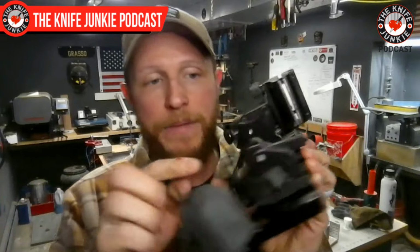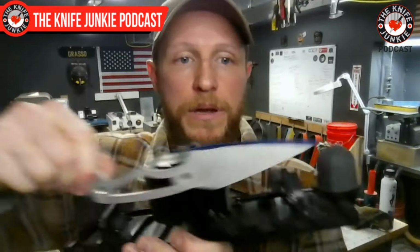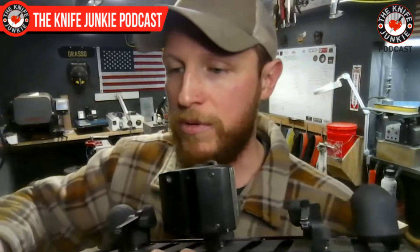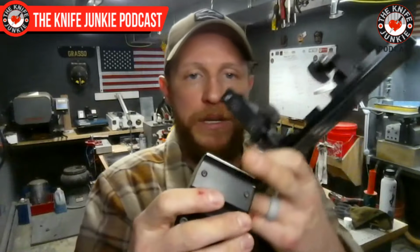You've got little tabs where you can adjust it so that when the blade goes into this clamp here, they can rest on these little arms, and it's fully adjustable. This top part comes down. It has file guides. I use an additional file guide in front of that, but the knife gets clamped in here, and then you can reverse it either way. It's very efficient, and it's almost like having a CNC in a sense. If you buy this tool and you have a good grinder with a carbide platen, you can get phenomenal grinds.